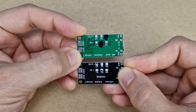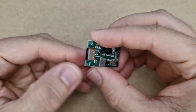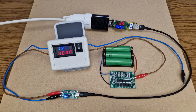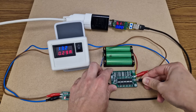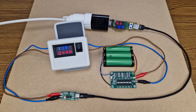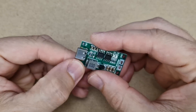These USB Type-C boost converters have a predefined output voltage and current depending on your battery pack. They need a simple USB charger without fast charge or power delivery protocols, and can charge up to a 4S battery pack. I will test this one, made for a 3S battery pack, with a maximum current consumption of 2 amps from the charger. I will connect a simple 5-volt USB charger to the converter — the output voltage is 13.1 volts, slightly above the maximum of a 3S pack. The current charging the battery is limited to 400 milliamps, and the maximum current consumption from the charger was 1.57 amps — an efficiency of 64%. The efficiency is lower than the power delivery method, but this converter is cheaper and simpler, so it depends on what you need for your project.